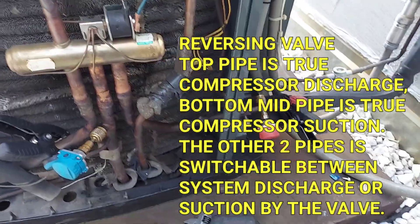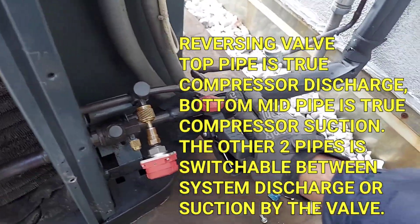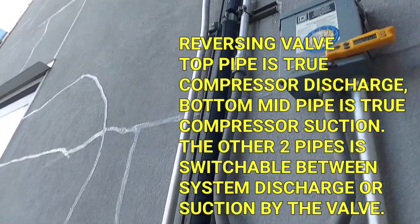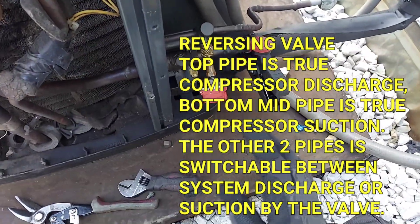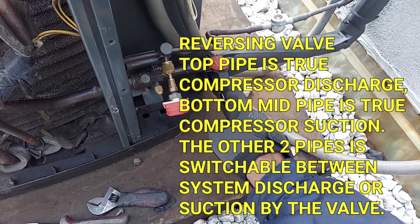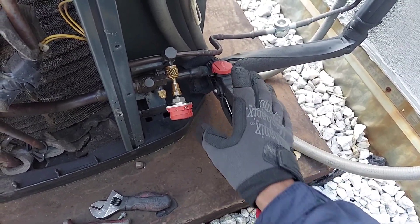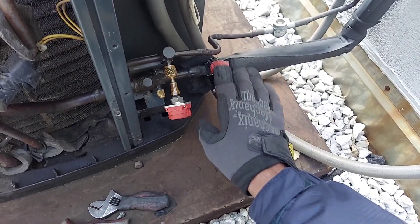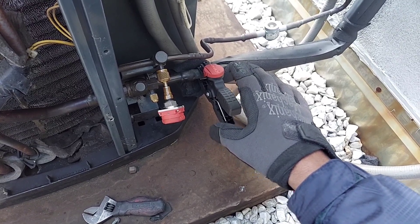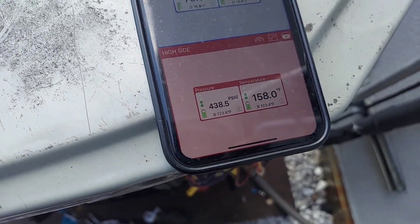Alright, so in a typical conventional cooling system, this is your suction line — it's all insulated, it's a larger pipe that goes inside to the indoor unit. And this is your liquid line. I'm going to show you my suction line temperature, which is now my discharge line, or compressor discharge line. That's the pipe going inside that's going to reject the heat, so you're nice and toasty on the inside. That pipe currently is 156 degrees.